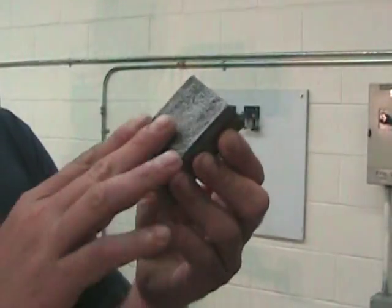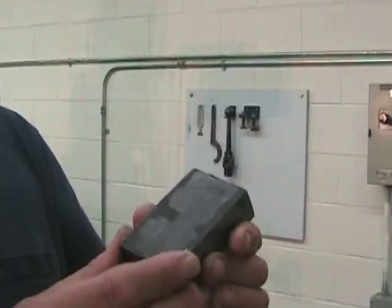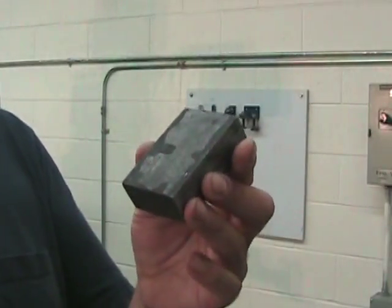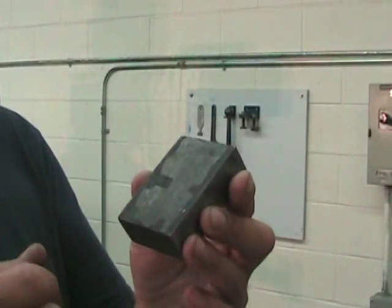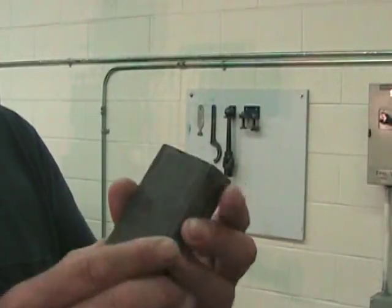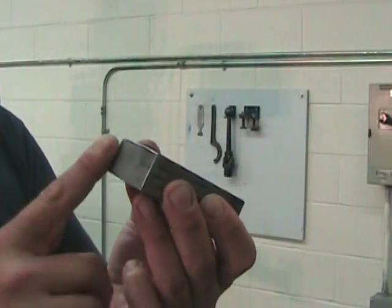We can see here that I've cleaned my first primary surface and both of my secondary surfaces. I haven't cleaned the second primary because that's the one we're going to cut, and it will become the reference surface for all the other surfaces. Now, I haven't cleaned my tertiary surfaces because they were cut with the bandsaw and have no scale on them.